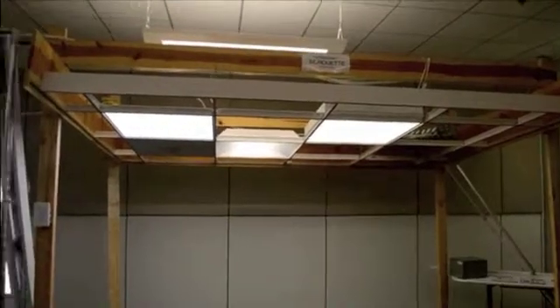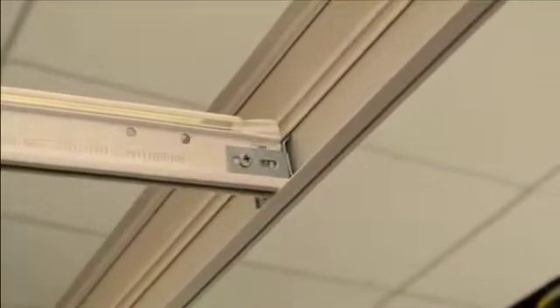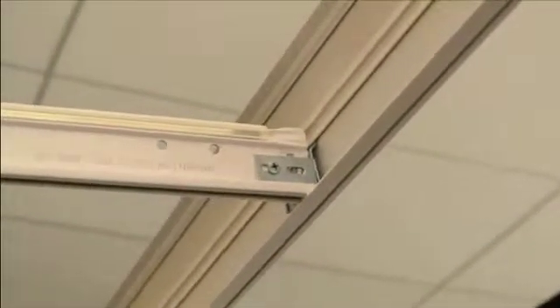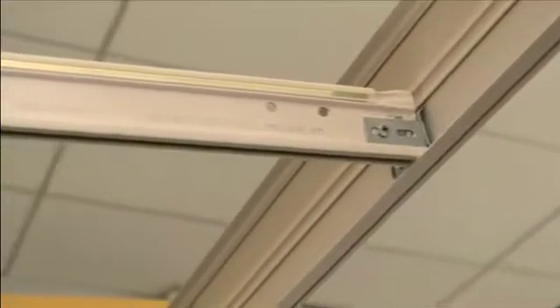When terminating into axiom, a small cut border main can be difficult. While it is not possible to cut a DC flex zone powered main runner, you can cut the stab-in detail off so that the main will sit on the axiom perimeter trim. This view shows that the silhouette main is not cut except for the tab at the termination into axiom.